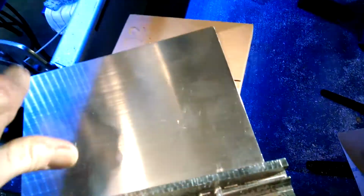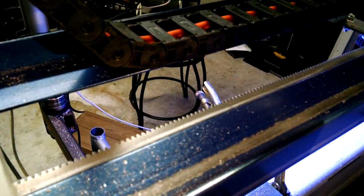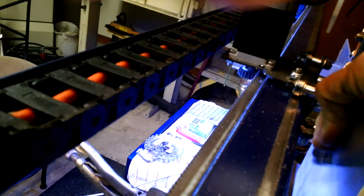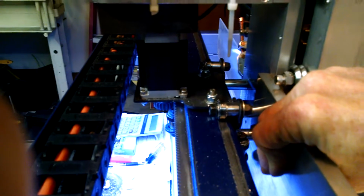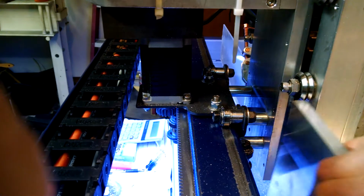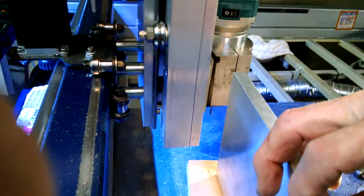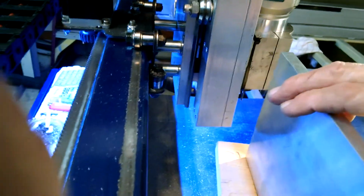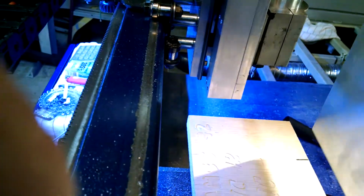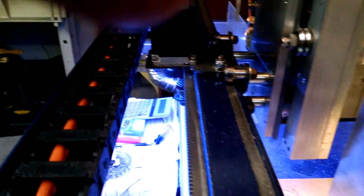We've got a plate of aluminum. Let's see here. I got a piece of 1/2 inch stock that I'm going to use for making a bracket that's going to attach to the back side of here. It'll bolt to the Z carriage, and the V-groove wheels like these here will be mounted to this. And we also have to incorporate in our work a motor mount to come off of this to tie back into our track.